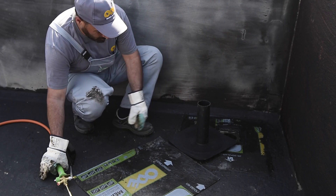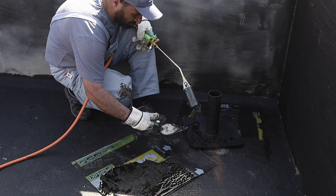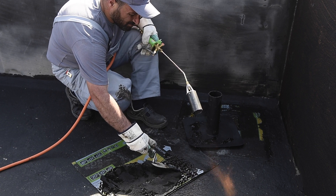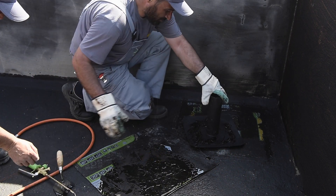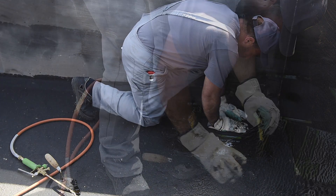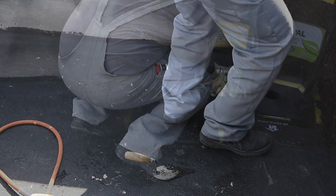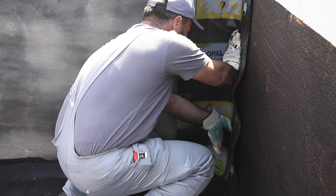Vertical rain outlet must be adhered to its place after being covered with bitumen from a melted membrane piece. For vertical corners, pieces of membrane must be cut in proper dimensions and adhered with a welding torch so that an inner corner can be achieved.